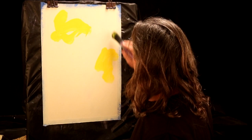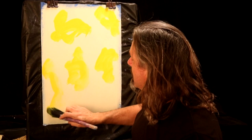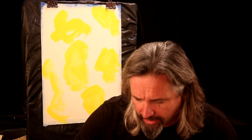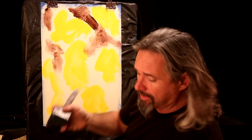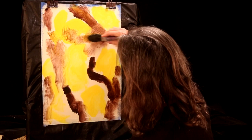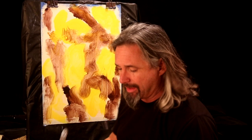Let's take the yellow first — it's very bright. On a big wall I'd be using six-inch rollers, and on really big walls like some of the casinos I do, I'll be spraying the glaze. That's color one. Now color two — be very careful, this is a dark, dark brown. See how dark and strong that is? That can overpower, which is why I put the yellow on first to control it. If I put the brown on first, I might be tempted to go real heavy-handed and have a big mess.